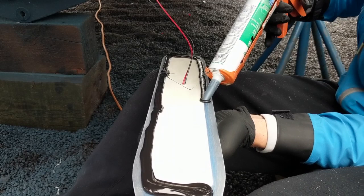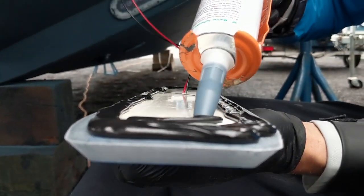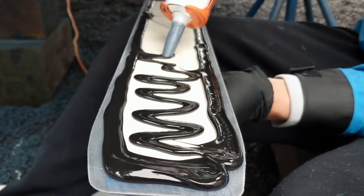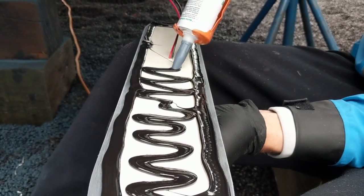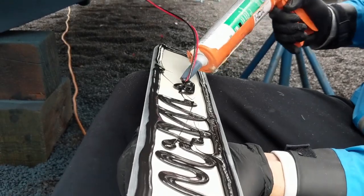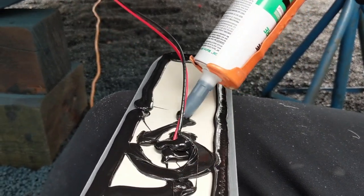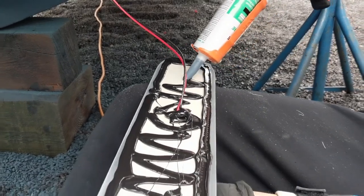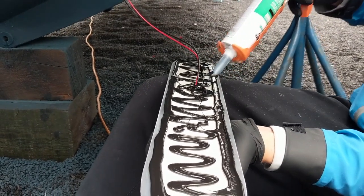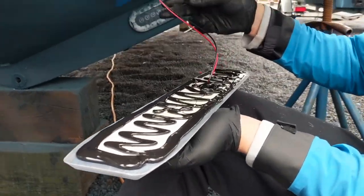If it's going to be on a running surface, you want to make sure it's completely laminated on the boat. Run a nice fat bead all around the perimeter, doubling up on the ends, then go across the back of the light. The bead should be about a quarter of an inch tall and over half an inch wide. Completely coat the back of the light and go up and around the wires so those are completely sealed. That's going to fill the hole, especially on this aluminum Armstrong bracket. You don't want any gaps — the last thing you want is water intrusion behind the light.